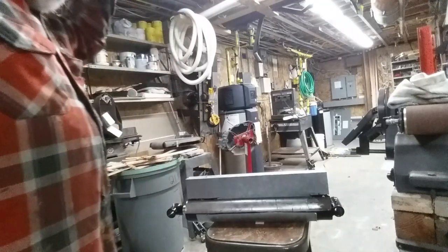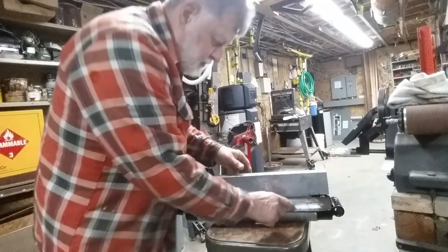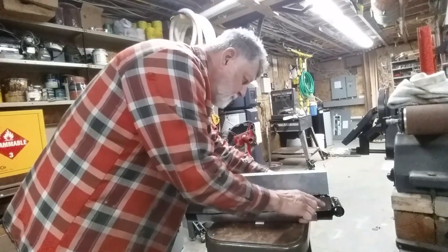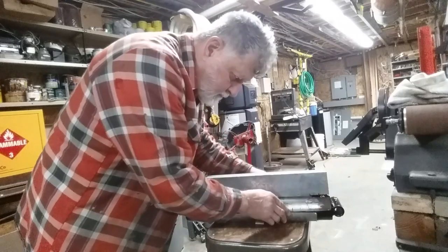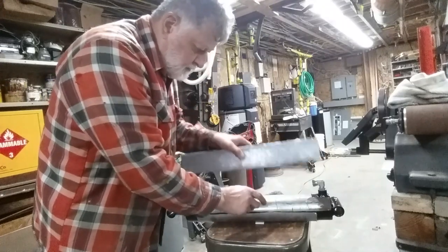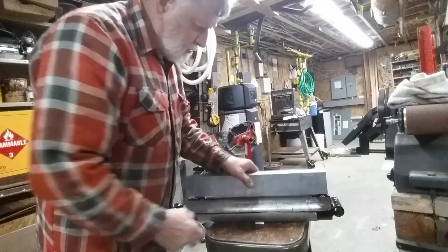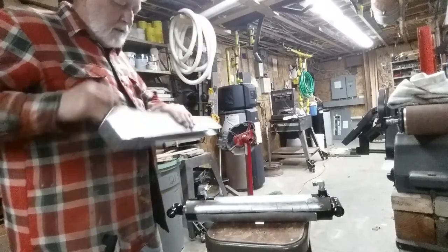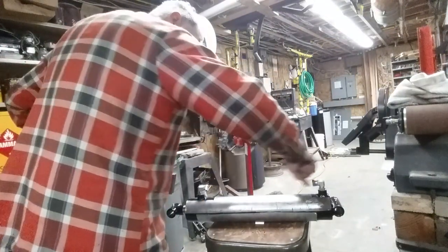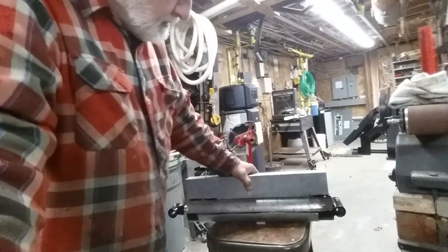Now, the problem with that is you can't get to the hoses. So I was going to make a piece here, probably at the end, and here and in the middle, weld it to the EMT, and then put a bolt through so that I could remove this. And of course I'd have to cut out where the hoses come out, because the hose comes this way out and this way. So someplace in the middle I'd have to make a piece.